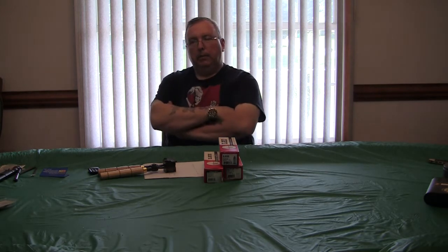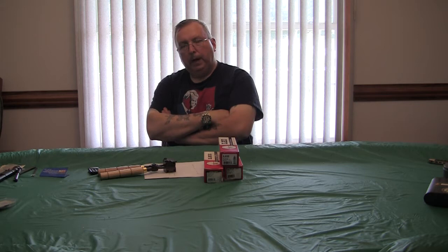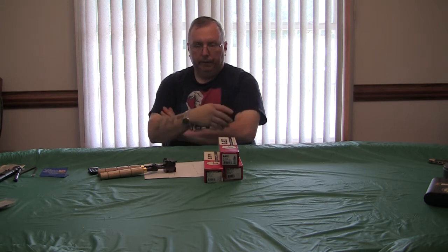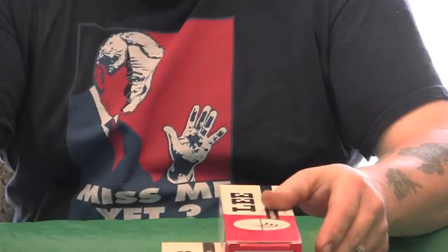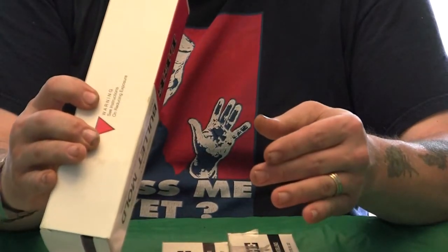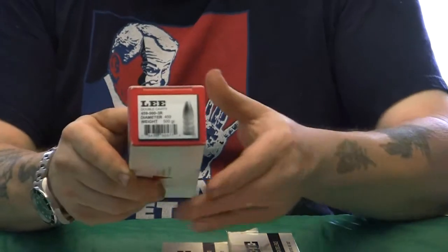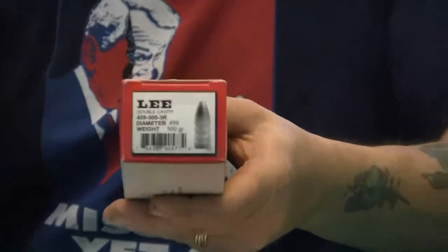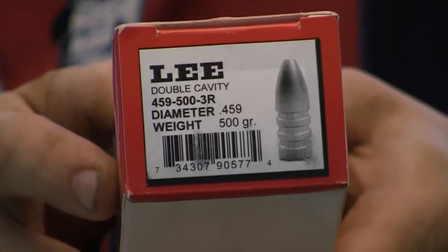Our basic thought here is you've got to know the groove diameter. On average it's .460, and the problem most people have — regardless of whether you load smokeless or black powder — is they're using the wrong diameter bullet. I have some bullet molds here. This one is a Lee, .459 diameter, which is good enough for the 4570. This is a more modern long-range style; I actually bought it for another gun of the same caliber, but I may develop a load for it.